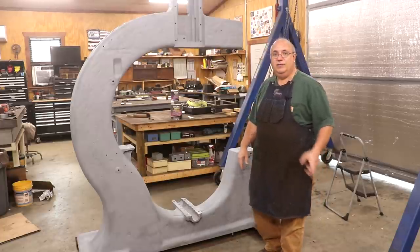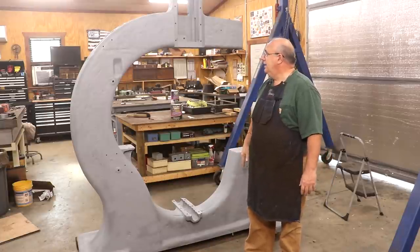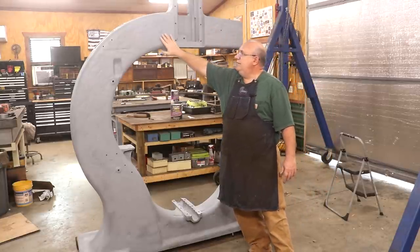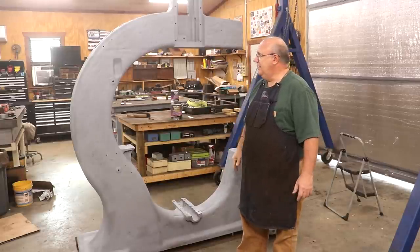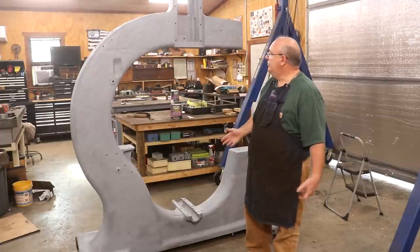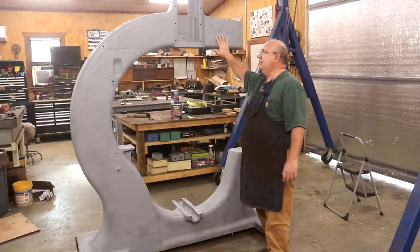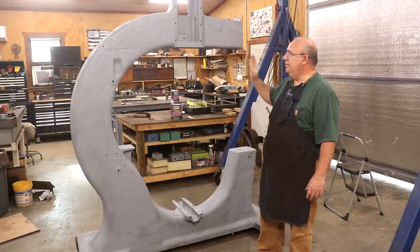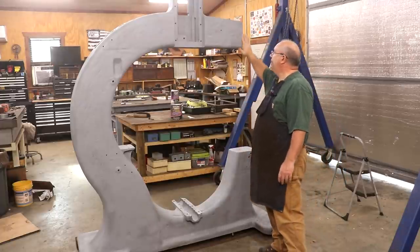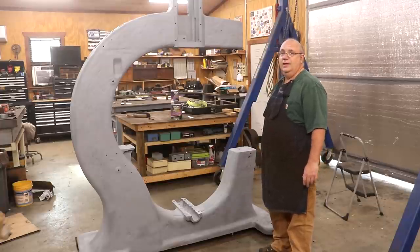The last video in this series was about this casting — talking about how it was made and some interesting things about it. We did some close-up shots and you could really see that it is a fairly rough casting, which is not untypical at all on large castings like this. In fact, all of them would have received some filler in the factory before they were originally painted. We had this bandsaw sandblasted, so all the paint and body filler that was on here before was removed, and we're starting from the base material again.